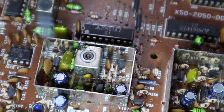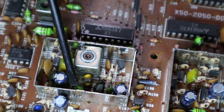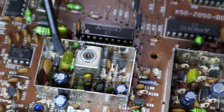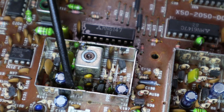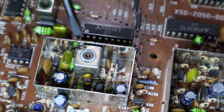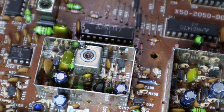One thing I may not have shown earlier is that I did a voltage check from this leg of this inductor to ground and measured about 1.7 volts DC. According to the service manual, I should have five volts here. So something's really off, and I don't think it's just the goop residue — I think there's another problem.